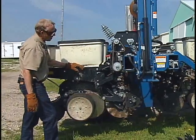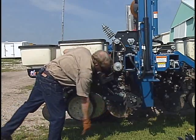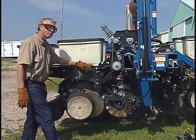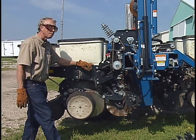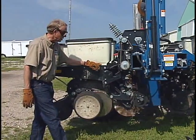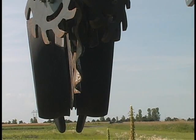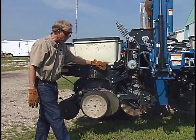On this particular planter, there's a combination row cleaner and then a coulter behind it. The coulter is there to slice through or cut any remaining trash — hopefully most of it has been brushed out of the way — and also to pre-fracture the soil for the double-disc seed opener. This happens to be a fluted style coulter; there are fluted and bubble styles, each with their pros and cons.